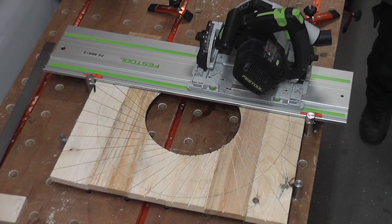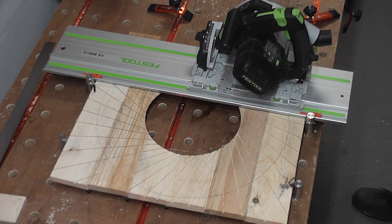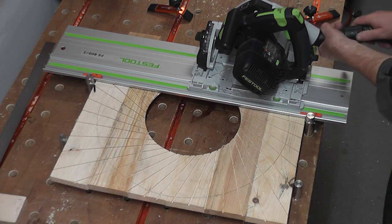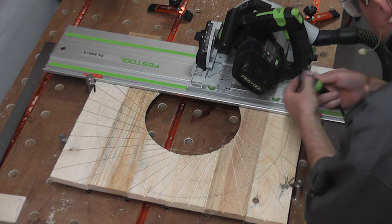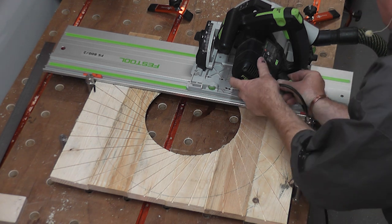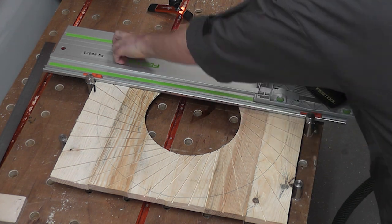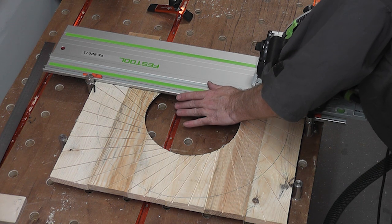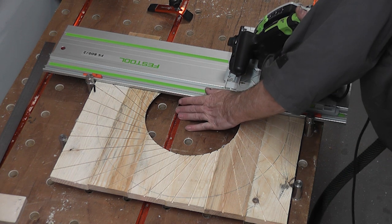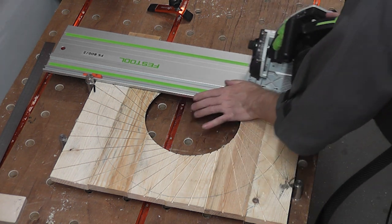Okay, so our aim is just to square this up. I've got to hold it here, hands nicely out the way. So other things we want, air, get the extractor back in. Power lead. Got my goggles on, so that's good. Lead up there. So first one, I'm trying to take bare minimum off the far side. Come back. Not too much tight to this. Drop it in. We need, I said I was closed. No, 2 mil.